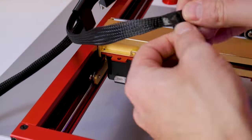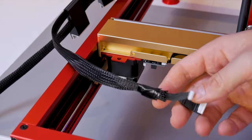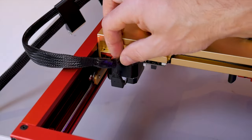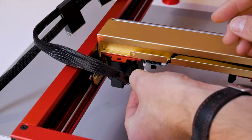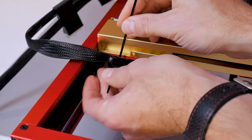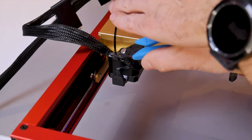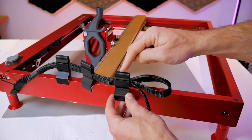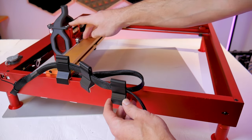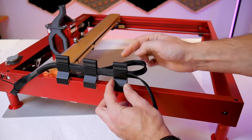While the ribbon cable already does have a woven sleeve around it, it doesn't hurt to have a little extra protection. I'm going to plug it back into the stepper motor and also reconnect the small harness that goes to the limit switch. Now you can see that the harness will naturally sit in this position where it was originally mounted and we'll replace that tie strap. This will keep the connectors from getting pulled on so that they'll never come loose. Now we can revisit the remaining two stanchions on the right frame member.